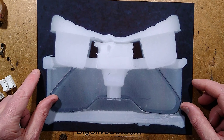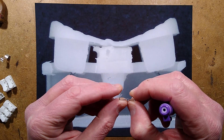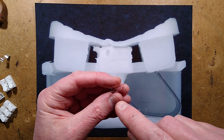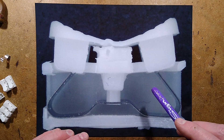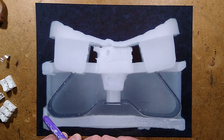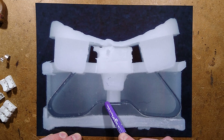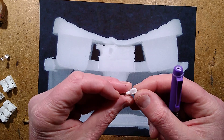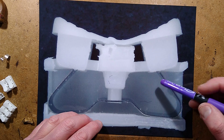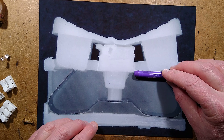I've taken one apart and took a picture, so I can show you what's inside. There's a spring steel — I'm guessing stainless steel — tang. It does very lightly stick to a powerful magnet, so I think it is stainless steel. It's slid in from the side, pushed in from the end with a little end stop during manufacture. Then a blade on top with a square shaft is pushed down through a hole and locks it in place. When you push the fins down, they push that spring plate down and allow you to slide the wire in between them.